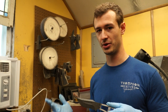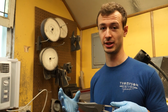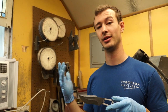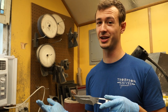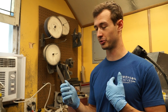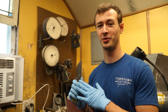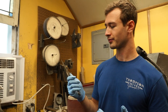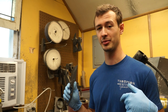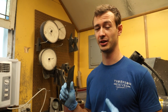The thing is, that won't give you as even of a finish — especially if it's a water bottle or something long, you're going to get more of a linear scratch pattern. With a vibratory tumbler it's all around the piece, constantly vibrating, so it gives you a more even pattern. A good way to get into it is to just fill something up with rocks, put a knife in there, and shake it around and experiment. Stonewashed finished blades is one of my favorite finishes because it looks so cool, and it's also very durable — if you scratch the blade, all it does is add to the finish. If you have any questions ask in the comments below, share with your friends, and I'll see you in the next one.